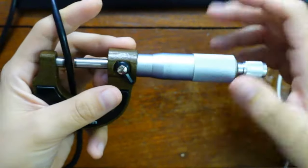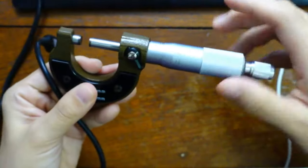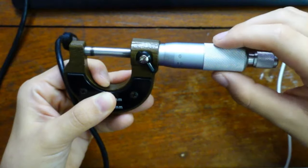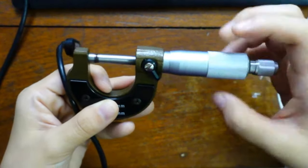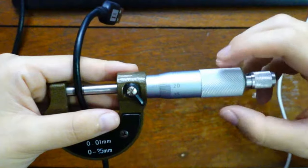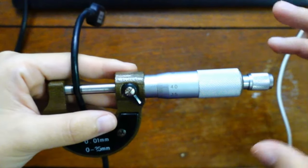A second way to do it, and perhaps a more reliable way, is when you're testing your zero error, you close it up first. You feel the tightness of this. When you feel like it's locked closed already, you will know it. Then you recognize that feeling. This one has to come with experience. Then you put the item inside there. When you feel that tightness, you stop. So there's two ways to do it.